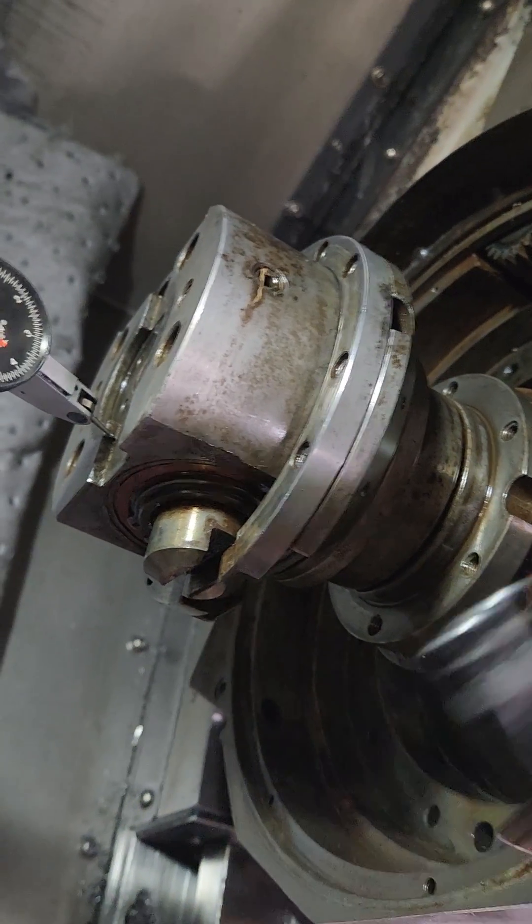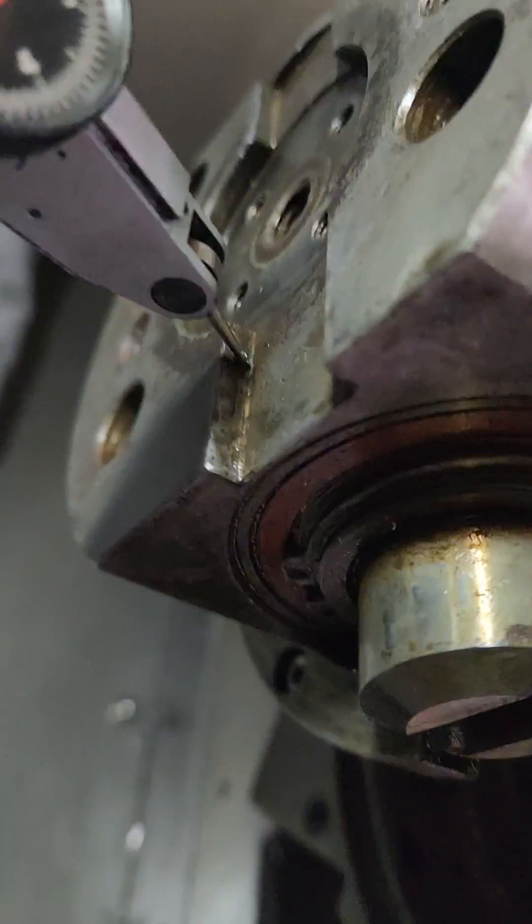Right now the turret — I could line up zero to X-axis travel, the live tool was 200 thou out. The way they lock it, like I said, is with a taper lock on the back side. So really I didn't have to take the piston and the couplers and all that stuff out. So if you ever do one of these and the live tool is not lined up anymore, that's all they hit was a live tool drive. Hope this helps somebody on a Daewoo or Doosan turret.